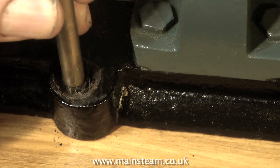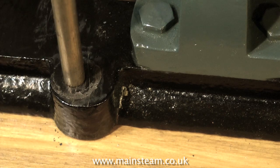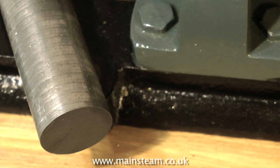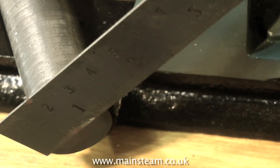So I'm going to re-drill the holes, but first I need to plug up the existing holes. This is a cast iron base plate, so I have some cast iron here that I'm going to machine to fit in the holes. The smallest diameter cast iron I could actually get was 1 inch, so I'm going to machine it down to 5 sixteenths of an inch diameter.